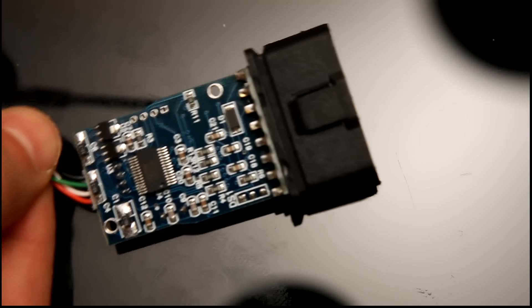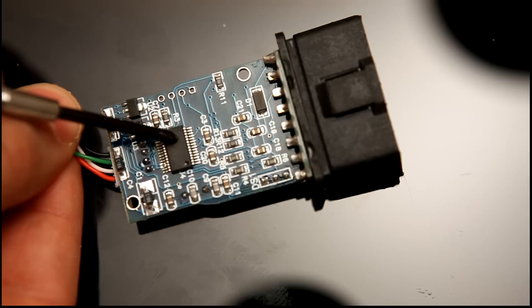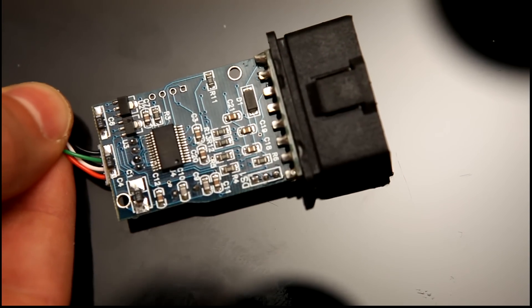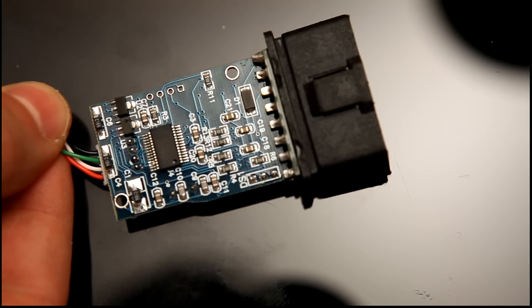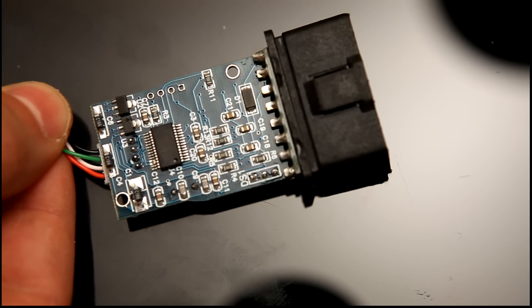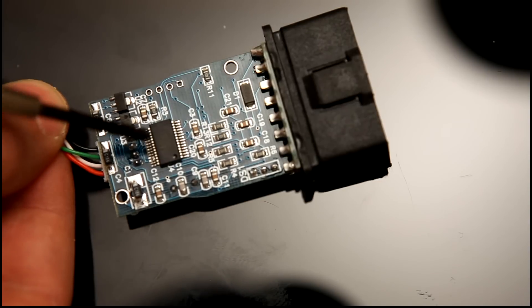There's a little bit more going on on the back as well. This here is an FTDI FT232R — you can probably guess what that's going to do from the 232. It's a USB interface chip which basically creates a serial port out of a USB, so it's a monolithic serial port emulator.